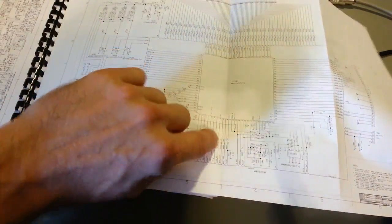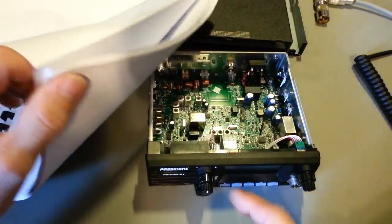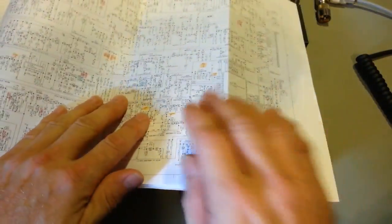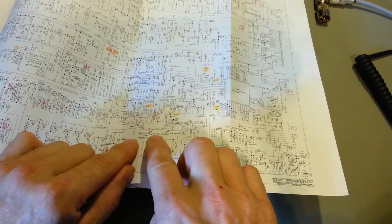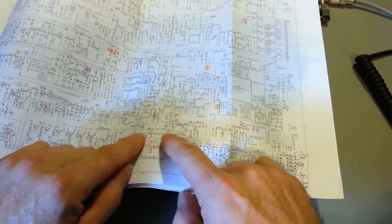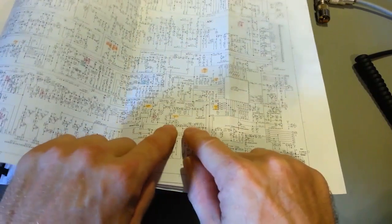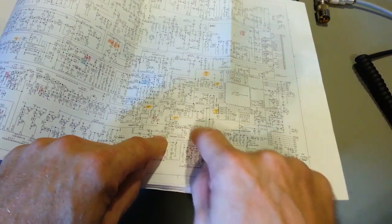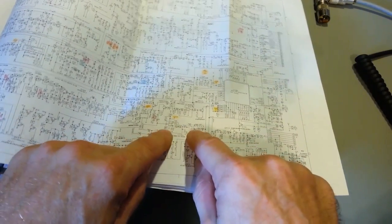Instead of a single tone when you press a button, the Roger beep is a multiple tone beep. That's the only difference. But they're using the same line and it just branches off, but it's not being switched. And the problem is, it comes in through the switching transistor, the transmit or Roger beep mute function here. This is our microphone amplifier, okay? It's a dual op amp, and it also forms a low pass audio filter as well.